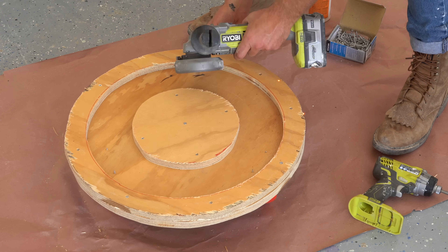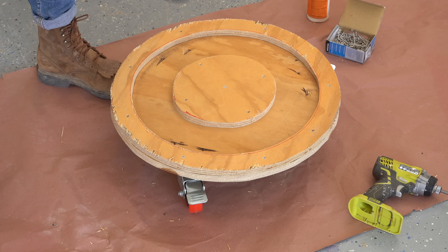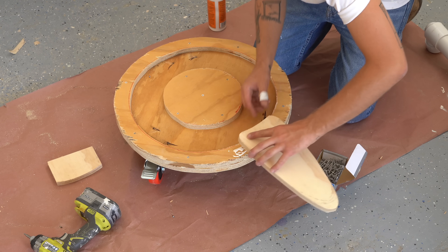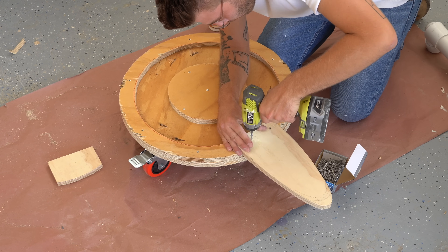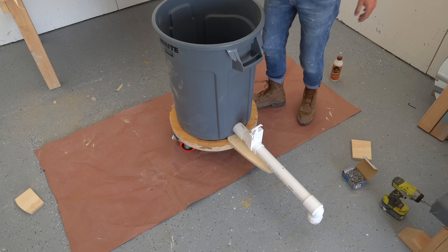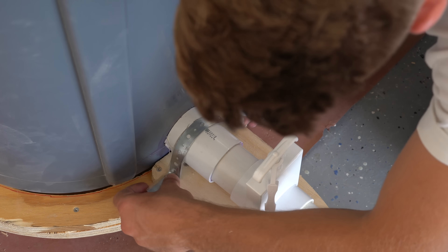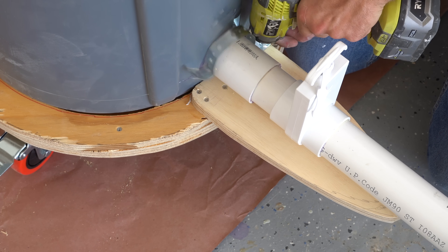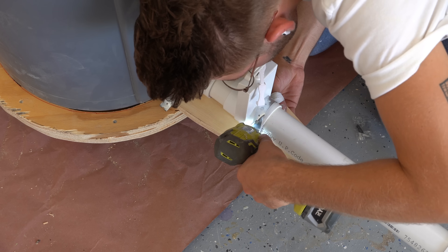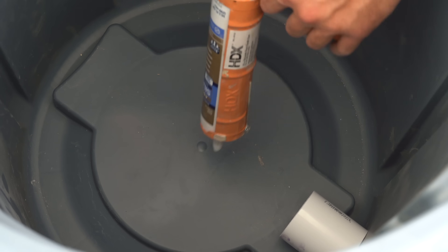I did have a little bit of a brain fart and I used too long of screws on the single pieces of plywood. So after I cut those down with my angle grinder, I added a support block for my PVC spout and made sure to glue and screw it in place. Everything that I used was two-inch Schedule 40 PVC, and I used a metal hanger strap from the plumbing section to hold my spout down. I'll make sure and leave a link to the gate valve and everything else I used in the description.